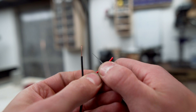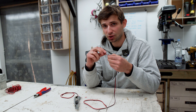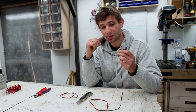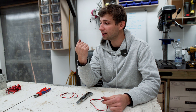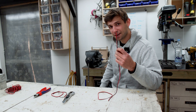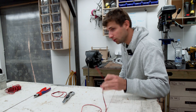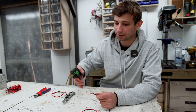You've got to be careful with this method because it's quite easy to slice your thumb and quite easy to damage the core of the cable — you just got to have the feel for it. I've been stripping cables like this for about 15 years and I have sliced my thumb so many times. This is definitely not the safest way, and a better option would be to use a handy stripping tool like this one.